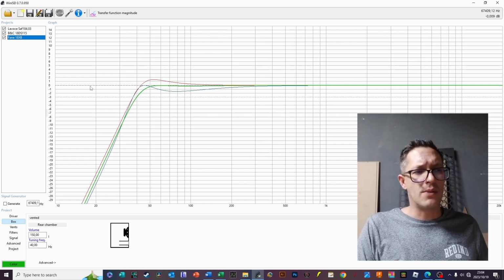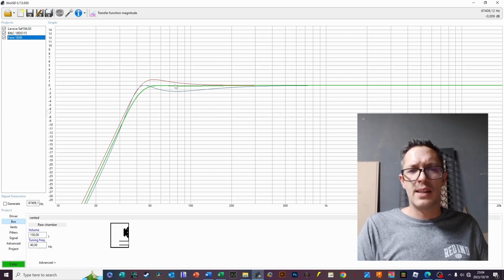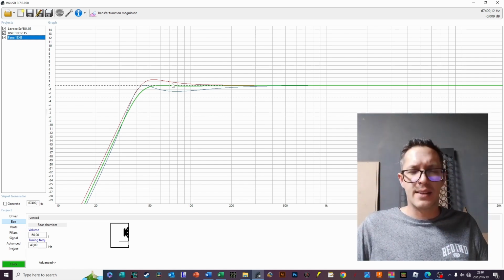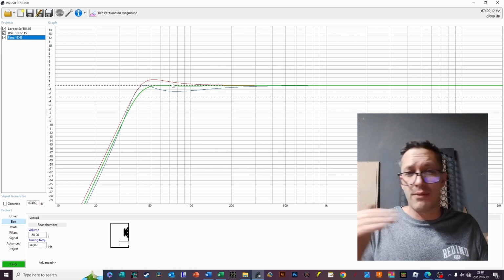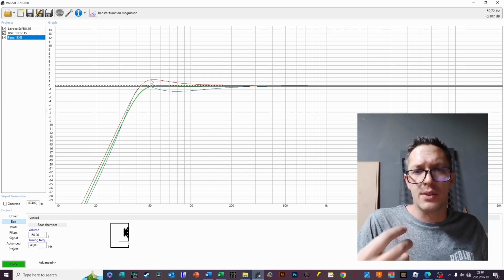Right here, we don't see how many dBs worth of loudness we can go. Rather, we draw an imaginary line through what we could assume being flat, right? And if we change something, we can see what's happening to the frequency response and its relative loudness, right? So 0 being flat and true, and if we've got a bump that goes into the positive, we can think of this as adding loudness to the system.